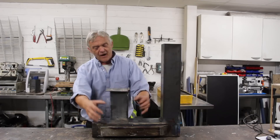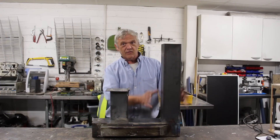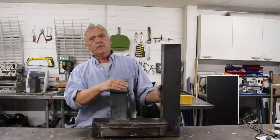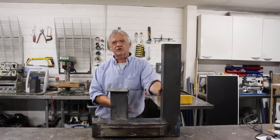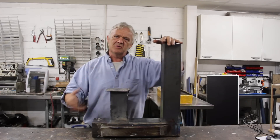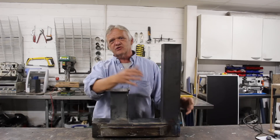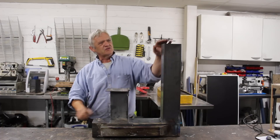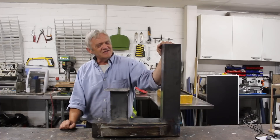The principles are the same - your fire burns about here, this is an extra air drawer, the air gets drawn in here, all those hot gases go here, and this section gets really really hot. That's the bit that you put a load of bricks or cement around. This is a four inch version to try that out, but you do a bigger version with a load of cement, sand, bricks, or whatever mass you put around there. That gets hot and when your fire is done it stays hot and gives out that heating - that's why it's a mass heater, much great for heating your house.